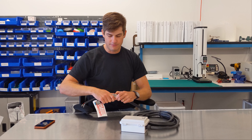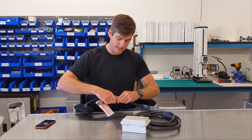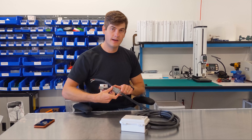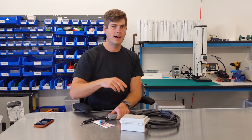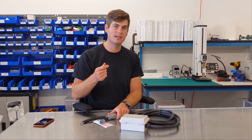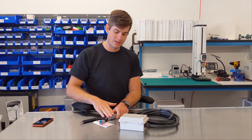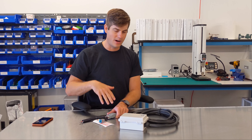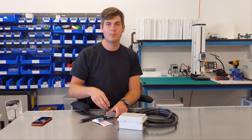What you can do is on the 12-pin Deutsch connector attached to the wiring harness on your wind machine — just pull that apart and then plug it back in, making sure you hear the click. That will reset the device so any settings changes you make will automatically update. Just make sure when you do this, your hands aren't near any moving pieces on the engine, because the engine will start pretty quickly.